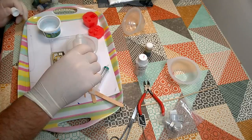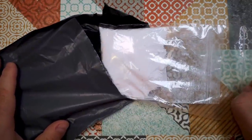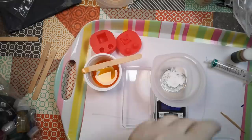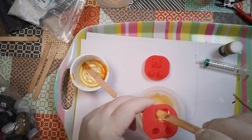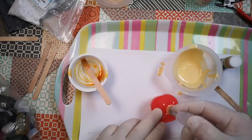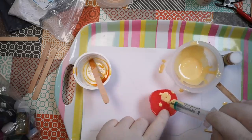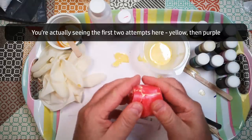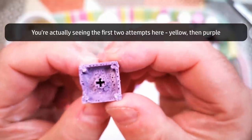I mixed up some low viscosity epoxy. I don't have any degassing facility, so I'll need to be careful not to make too many bubbles. I want my keycaps to be fully opaque, so I ordered some titanium dioxide powder. There is nothing quite like the worry of receiving a bag of white powder in the post. This stuff's really finely divided, and I hoped it would just make the base resin white, like milk. I also added some alcohol-based dye to give it a tint. I then poured a bit of resin into both halves of the mould to properly wet the corners and difficult areas, then mated the two halves together, and using a small syringe, I injected resin down through the filling hole until I saw it rise up out of the opposite holes. I left the resin to cure overnight — much longer in fact than its prescribed cure time — and I didn't throw away the mixing cup, as this provides witness to the cure state of the resin inside the mould. Pulling the keycap out of the mould requires a little care. I trimmed off the sprues and flash, and here's the end result. It's not good enough. The colour is poor and there are lots of bubbles. Must try harder.